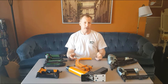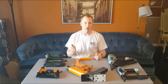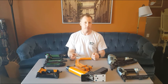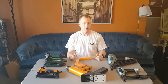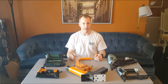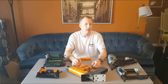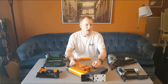The other type I haven't talked about is a concrete-fastening nail gun — guns with enough power to drive nails into concrete, whether you're installing metal drywall track down to concrete or sill plates onto a slab. You can get a pneumatic nail gun powerful enough to do that. One great feature is that you don't need to be licensed to use a pneumatic nail gun that shoots into concrete, unlike the powder-actuated nailers shown in my previous carpenter tools video.